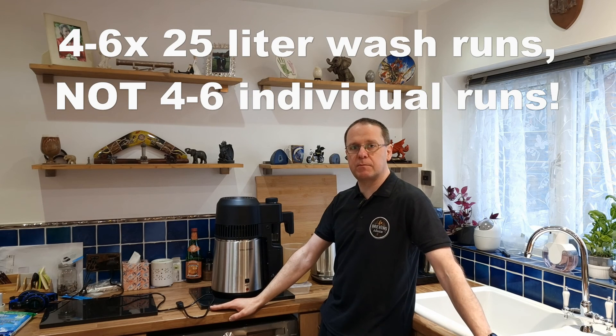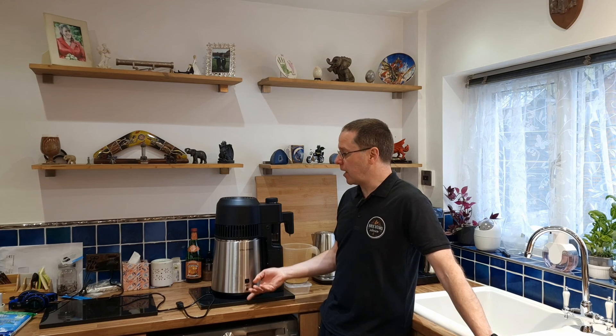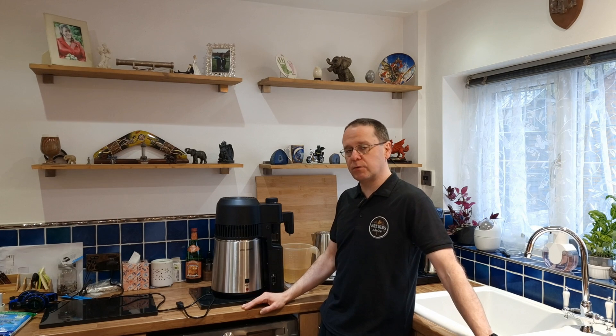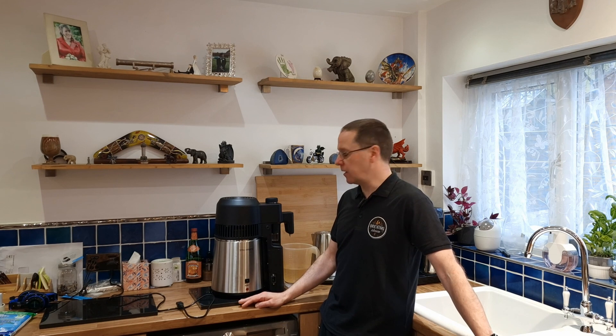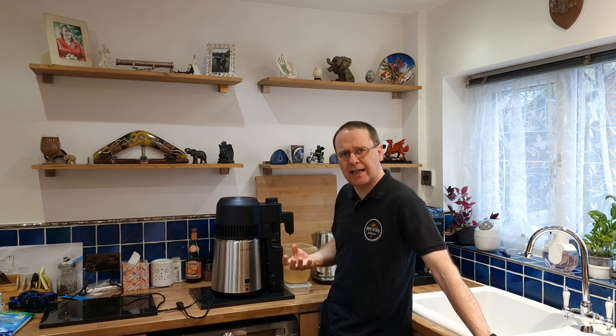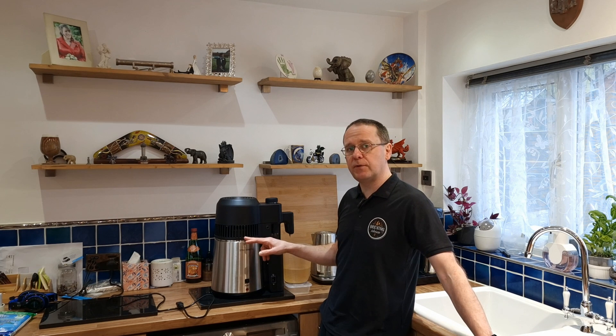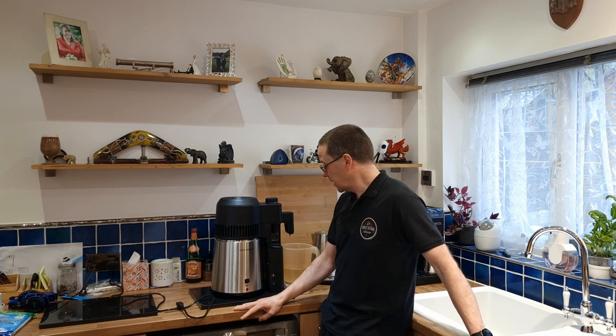For ongoing maintenance: most people should clean it every four to six uses. You don't necessarily need to do a full clean every time — every five washes I clean all the packing with salt water and citric acid, then assess the still body. Sometimes I'll do a small vinegar run, other times a full run, depending on how it looks and smells inside. Also, if you're not using it for a few weeks or months, take the rubber ring out of the head gasket and store it separately so it's not always being stretched. Hope you found this informative — see you next time!